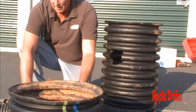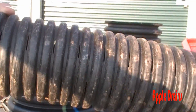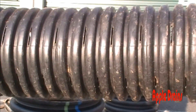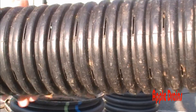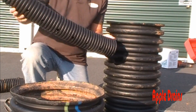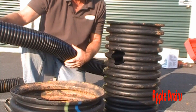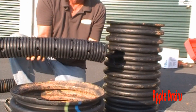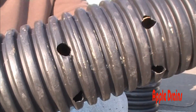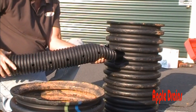Make sure when using perforated pipe that the holes point down. This is slotted pipe — you can see the slots go all the way around the pipe, so this one can simply be laid into the trench and water floods into the bottom, and also drops in as it rises higher. Both work really well. There's a blue line on this perforated pipe marking the top, so make sure those holes point down.